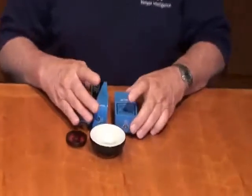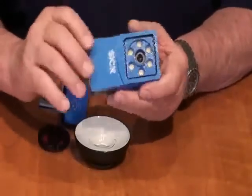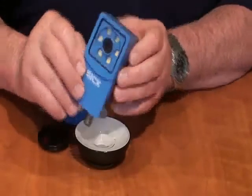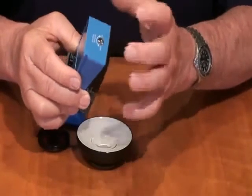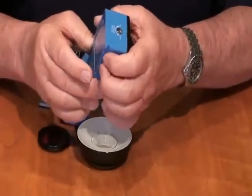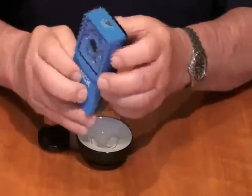Let's take a look now at some of the differences in some of the accessories we have available. You can see there are a couple of different versions of the product. It is an all-metal housing, making it very robust and allowing it to dissipate heat. It is rated as an IP67 enclosure. On top of the inspector is a screw that is turned, and that is how you do your focusing. The software aids in this — there's also a flashing light that aids in setting up the focus. It flashes more rapidly as you get better focus, and there's a sliding visual bar on screen as you adjust your focus, automatically helping you find the best focus.